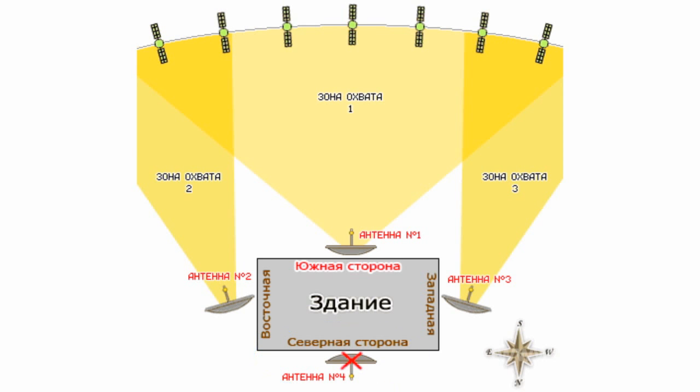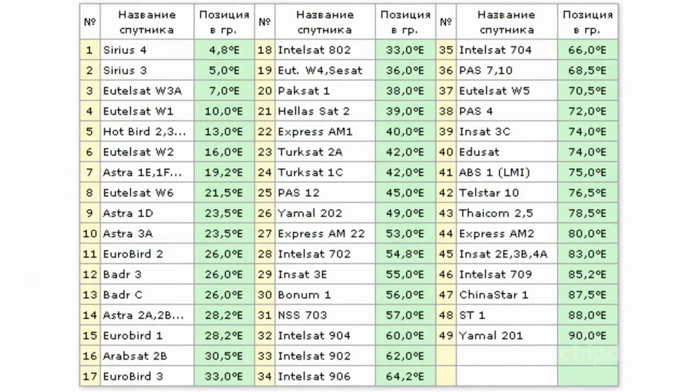Note that, in fact, our houses are located in a way far from being ideal. Therefore, when you select a location for your satellite dish, you need to ensure the maximum possible southward coverage so that it covers as many satellites as possible. In addition, you need to ensure its convenient location for adjustment and maintenance, as well as maximum structural reliability and integrity.